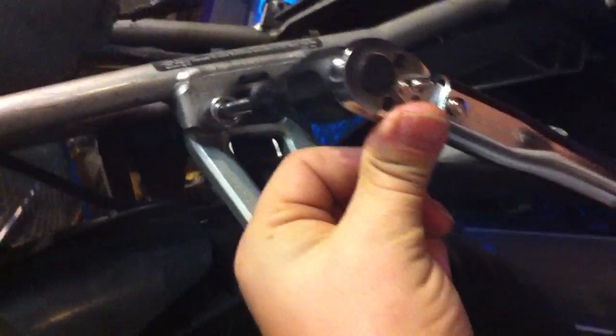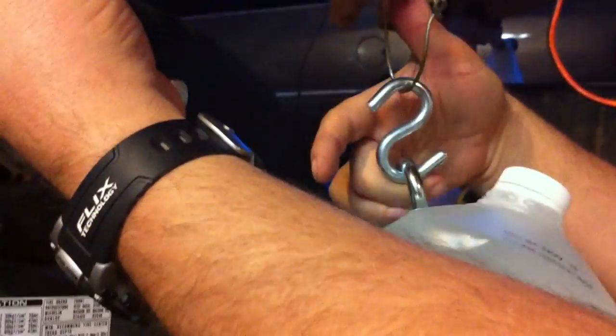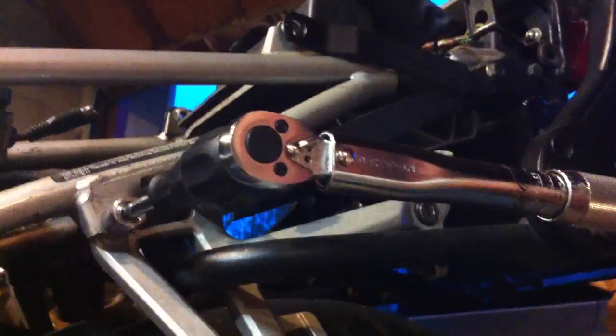So this wrench is set pretty much correctly, so I'm not over-torquing when I'm using the settings on this wrench. I know right around the wrench settings I'm using, it should be about right. It's 180 that it's calling for, and this is 166. So it's right within the framework, because a torque wrench is more accurate as you get up into higher numbers. I have other wrenches for other jobs where it's more intense.